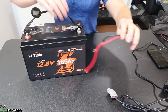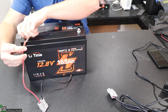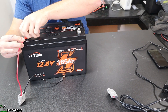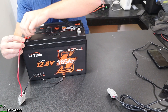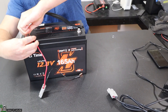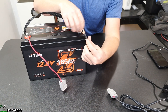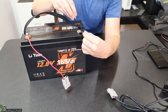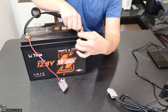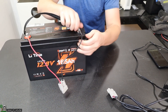I'm going to use the Li-Time charger to get this battery started with the self-heating mode and also charging the cells. If you've never used one of these smart batteries, you have to wake them up from shipping. You can do that by either hooking up a charger like this or using a solar charger. I tried this with my solar charger and it was not designed to wake up lithium iron phosphate batteries, so I did have to use this one from Li-Time — it took about three seconds for it to wake the battery up.